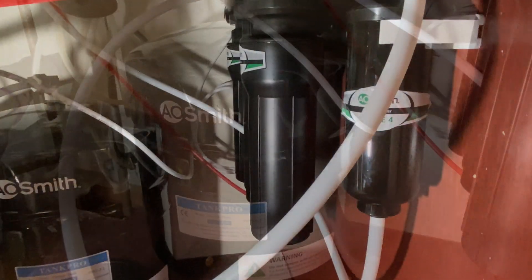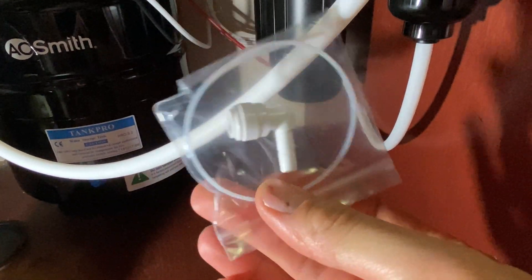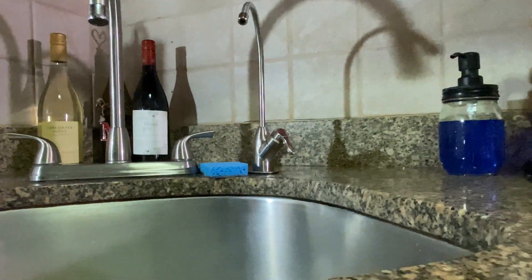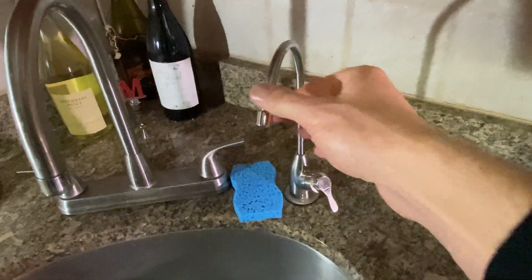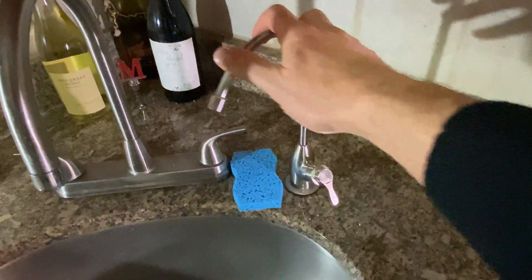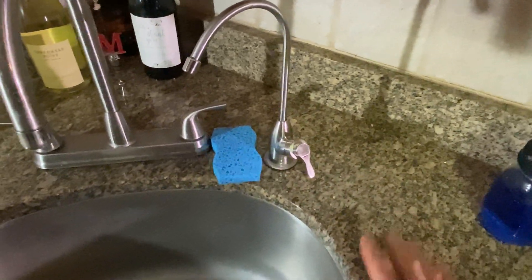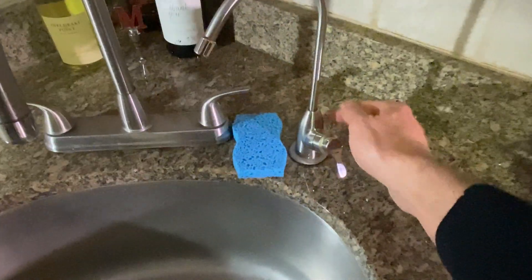Tanks are about $40 to $50. A more common issue, which we spoke about before, is the flow restrictor. The flow restrictor reduces the amount of pressure and flow up into the tap. On the back of all reverse osmosis systems, right about here, there's a hole — that's for air pressure to be released. Because if the flow restrictor breaks, water and air is going to be shooting out of here. The manufacturer doesn't want that, so they put an air release valve in the back. So if you wake up and the whole entire counter is full of water, water and air is escaping from that air gap — that would be the flow restrictor.